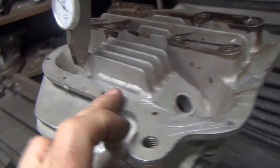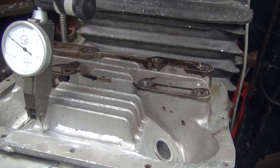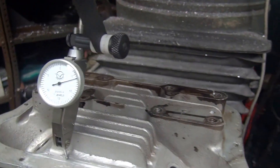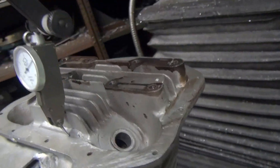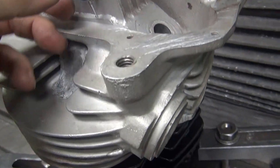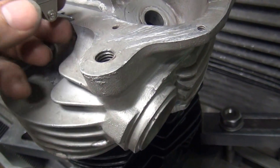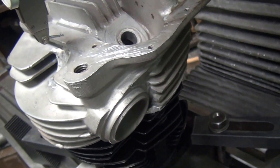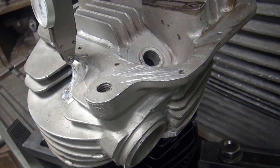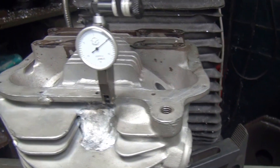I just went and squared off the head here. This is our only straight surface on the head that you can indicate off of for side-to-side angle. See where it hits the surface there — we're pretty square. Now we've got to come in here and figure out roughly where we're at on the side-to-side surfaces. Bring this down until it touches and put that on five right there.